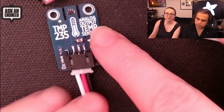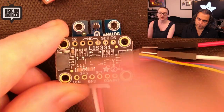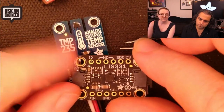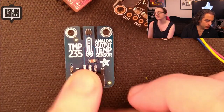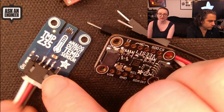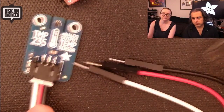I'm also experimenting with Phil B on making little Stemma breakouts. We have the Stemma QT boards, which are 0.7 inches by 1 inch and have the quick connects on either side, which is lovely — it's a great standard that SparkFun came up with. But I also wanted one for analog and digital simple sensors, ones that just had like one pin. We have the Stemma speaker that uses the same 3-pin JST2PH connector — it's just power, ground, and signal. We also have a servo with this connector. It basically just makes it plug and play easy. This is great for I2C, and then this is great for analog or digital.